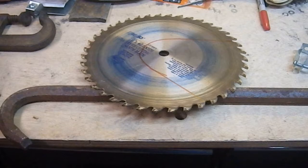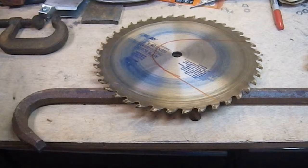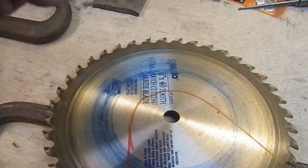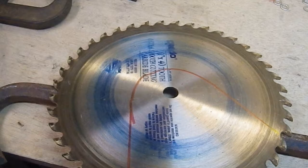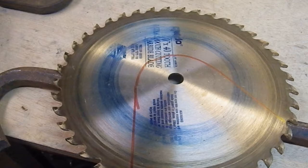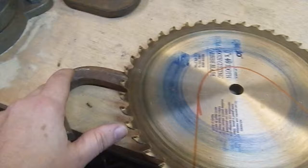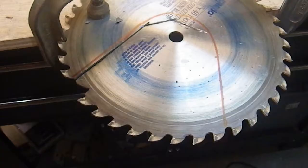I don't think movement is going to be a problem. This is going to be a heavy object — it's a crowbar, it's got a lot of energy behind it — and putting this saw blade on there is definitely going to create grievous wounds, which of course is the job; I am making a weapon intentionally. First thing I've got to do is make a relief cut here, plunging with the angle grinder, then start working my way toward it and hogging the rest out with a grinding wheel and then a flap wheel to get the shape I want.